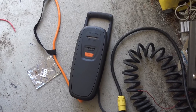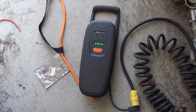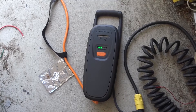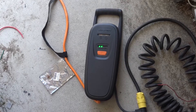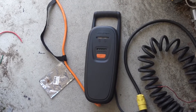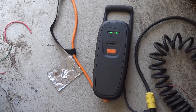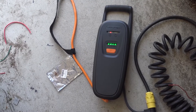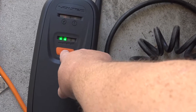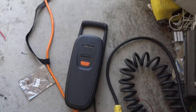So the unit is ready to power up — power on, green lights. It should go to green. The answer to that question is no, it is not compatible with 240 volts. The flashing red light indicates that the voltage is out of spec. When the unit is first powered up it goes through the power up sequence — it checks for grounding, checks for ground faults and so forth — and then it checks the voltage. If the voltage is too low or too high it will not turn on the charger.